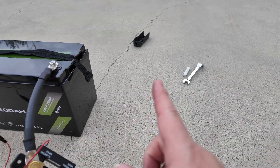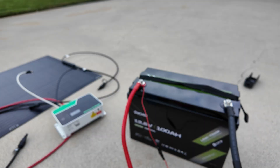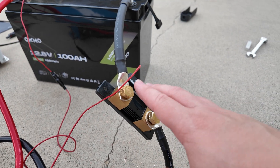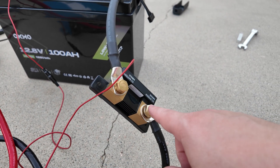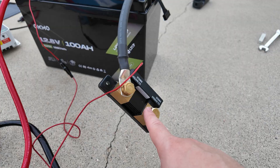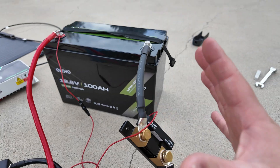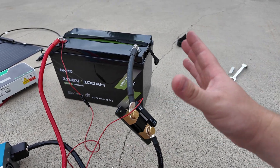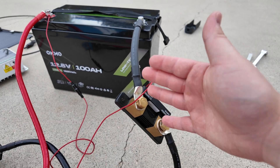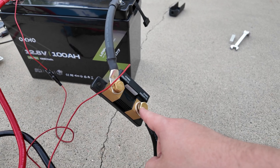Get a few odds and ends that will help you: a pre-charge resistor, a disconnect tool, and proper fuses for your batteries. And I can almost guarantee you'll want to know how much power is left in the battery, how much you've used, how much you've charged — that's where a shunt comes in. You can get smart batteries with shunts somewhat built in, and if you add a large quantity of batteries, it's nice to get a big picture of overall power. Give serious consideration to getting a smart shunt.